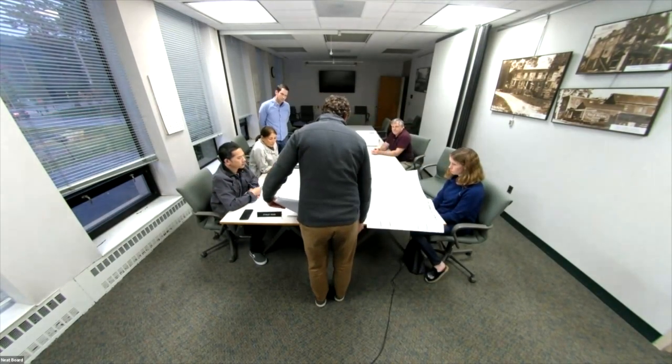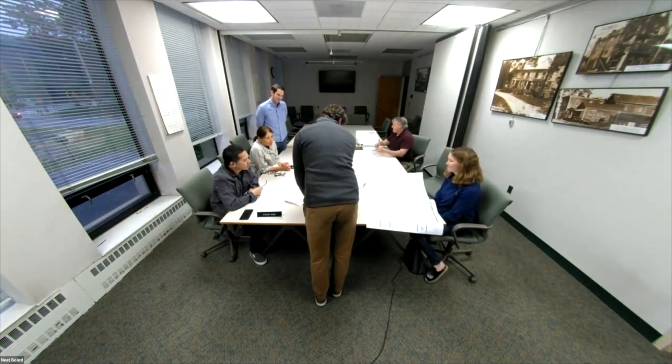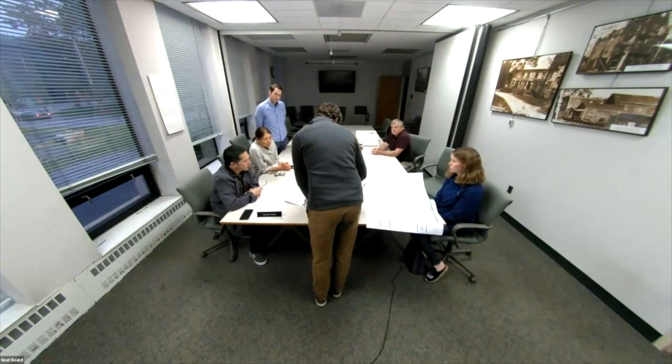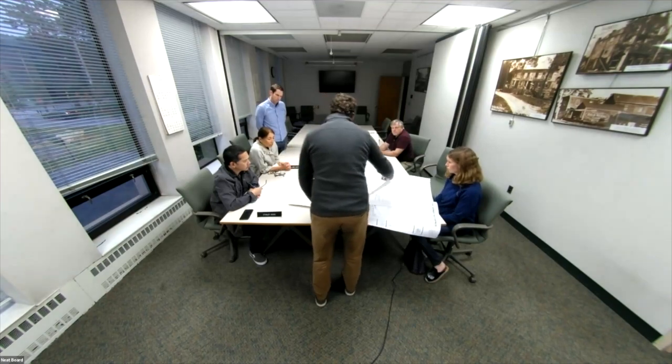So let me take that to the elevation. This is the rear elevation. Top of existing, this is new. So again, the roof is coming up here. We'll put some windows there. We're going to wrap that in casements. There's an existing window here that goes into the kitchen that is going to be replaced. Because this roof is essentially going to sit where that existing window is, we're going to split that into two. The style of the windows are all going to be simulated divided lights to connect with all the existing landscape view.